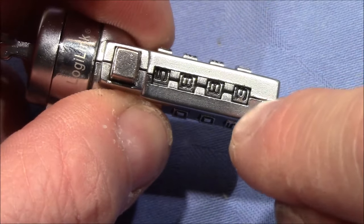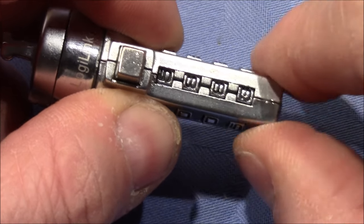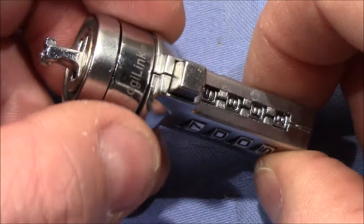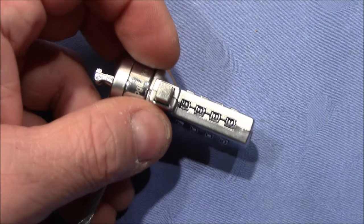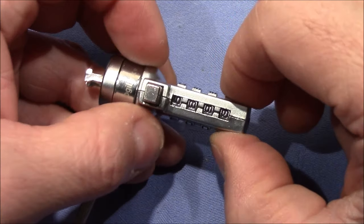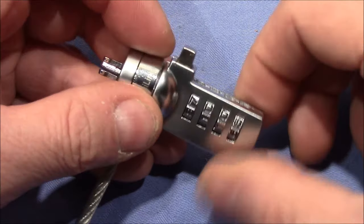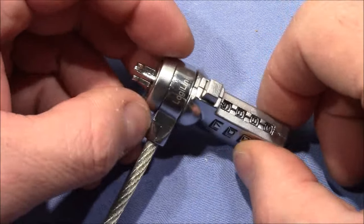You change the current binder one by one and see what impact it has on the next binder. This way it's very easy, quick and reliable to find the right code, if you cannot distinguish the position or the width of the gate when you change the binding wheel only. So this is a very good way to easily decode locks like this.